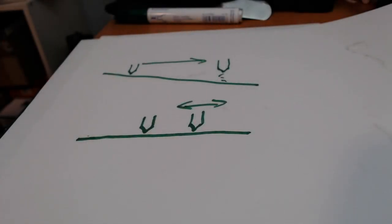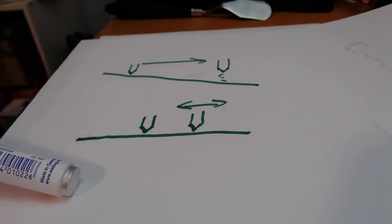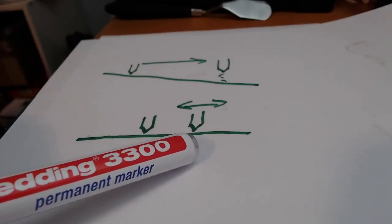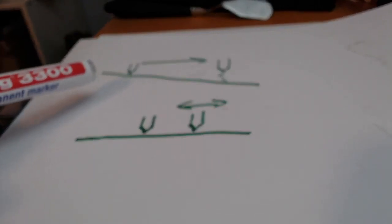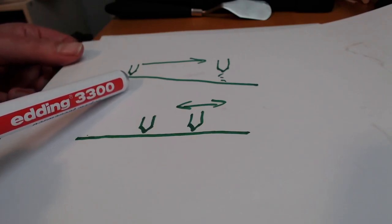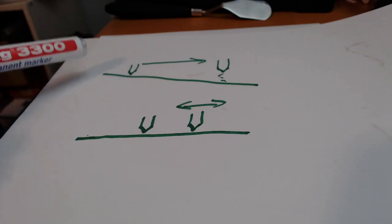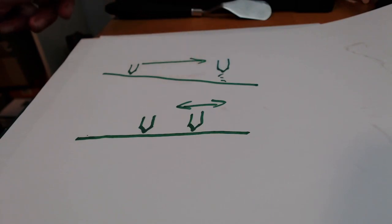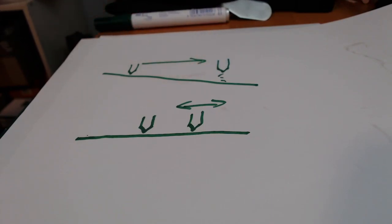Some words about bed leveling. Here you see a bed which is leveled nicely — when the nozzle moves, it stays at the same distance all the way. On the upper image you can see a misaligned heat bed where the nozzle has the right distance at one point, but as it moves the distance gets greater and this will cause failed prints. Later I will show you how to do a manual bed leveling on an Elegoo Neptune 2, but the procedure is the same for any FDM printer.